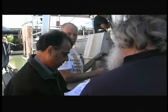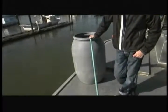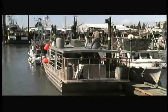All equipment on the vessel must be secured to prevent shifting during the experiment. All bilges and fish tanks must be pumped out. Cross-connected fuel tanks must be closed at the connection. All persons should be ashore except those conducting the incline, and the weight of each person on board must be recorded. We set up the weights and the pendulums, and we weighed one of the barrels of water so that we knew the weight that was going to be moved.